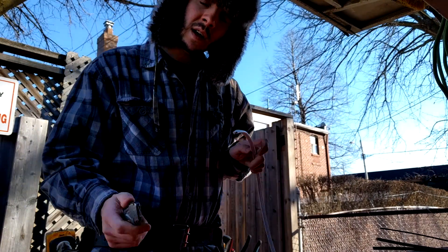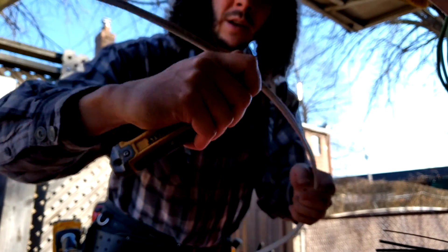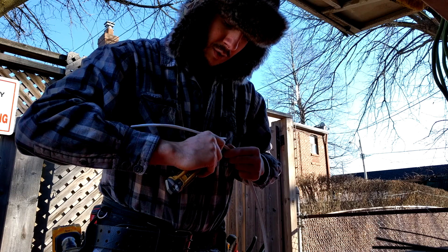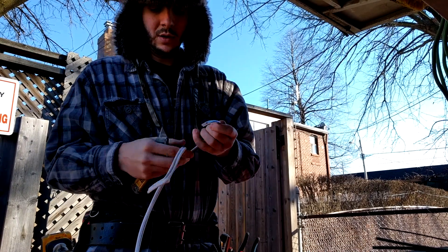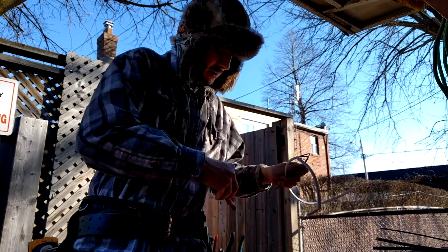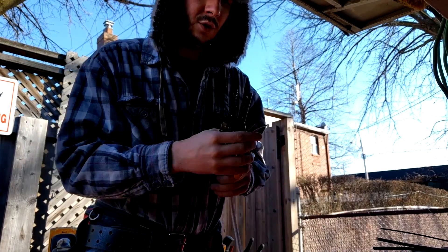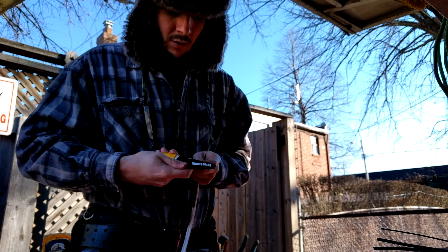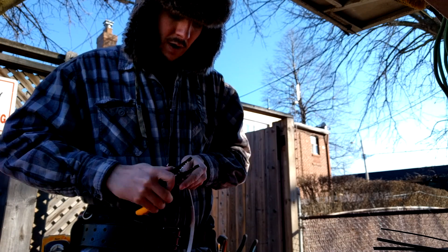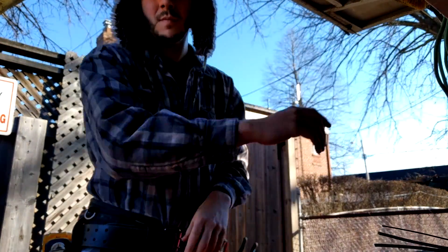Finally, a method I picked up recently that I'm not so crazy about myself, but I'm sure if you practice it, you get pretty good. Take the wire and set it up between the blade and your thumb, and just pull the blade back on that wire. Get a nice opening there, pull your two conductors out, and you can either use your knife or your side cutters to cut that little end off — gives you a fairly clean cut. Still, I think the best option is these residential strippers. Just pull the jacket off, strip your two conductors, and then you can bend your wire loops and wire up your receptacle right away. I think that's as clean as it gets. Thanks for watching.